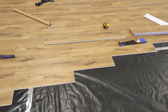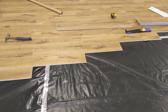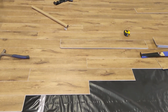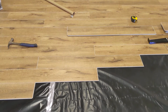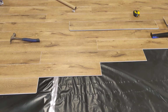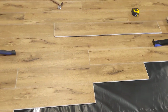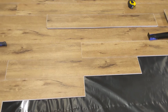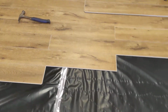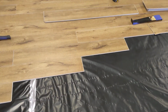If this was a thicker laminate, say 12 millimeter, you could potentially do that because it's so thick, it can handle multiple rows. But also, even in that, some of them have a very smooth finish to them and they slide and click together very easily. Others are not quite as well milled, and so you have to test this out with each one. But for this, 2 of them click together very nicely. Saves me a lot of time because I don't have to individually try to align and place each piece.